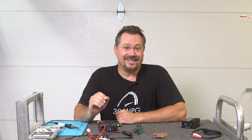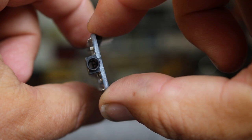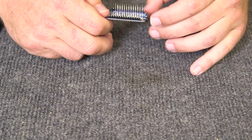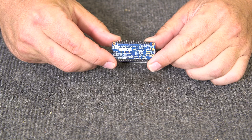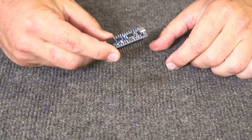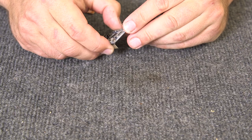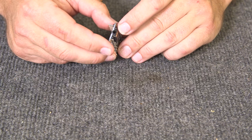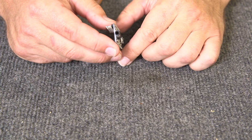What we're going to do is use a dedicated sound board to play back a WAV file through an audio amplifier and out through a speaker. The Adafruit sound board is very small and compact — it's not an Arduino, there's no programming. It just has pins as inputs; you ground one of those pins to activate a sound being played back. I like to mount it on a piece of perf board to make it easier to handle, mount, and do strain relief for cables. It also has micro USB for dragging and dropping audio files and a headphone jack as an output.